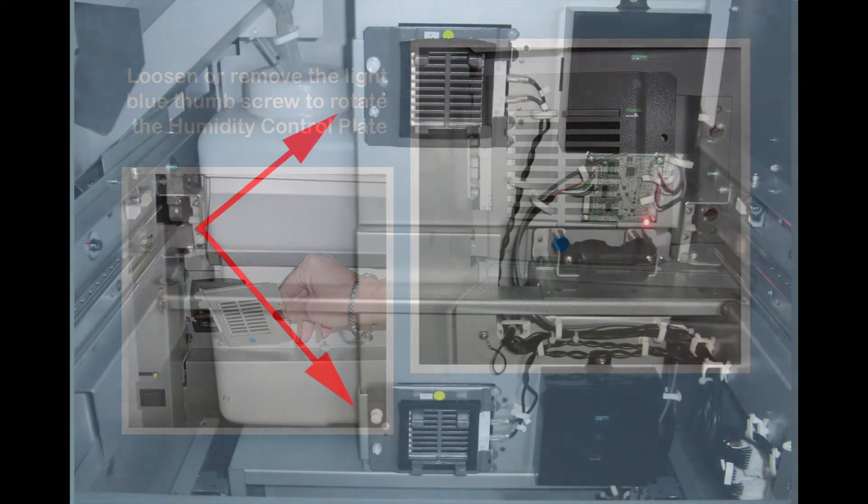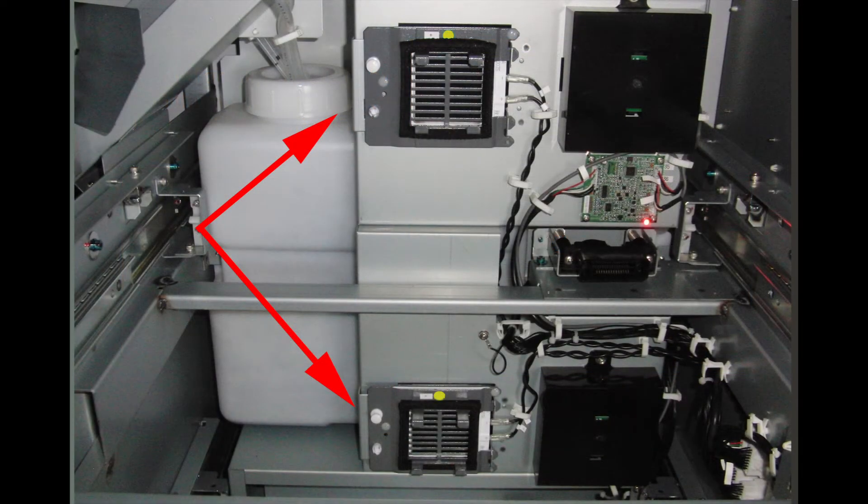There are two humidity control plates on the QSS Green 3, Green 2, and D1005 printers. To enable the humidity control unit for low humidity on these printers, attach the humidity control plates so that the plus sign and the yellow dot are showing for both the A and B magazine positions. Then turn on the power switch for the humidity control unit. When the humidity control plates are in this position, humidity is added inside the printer.